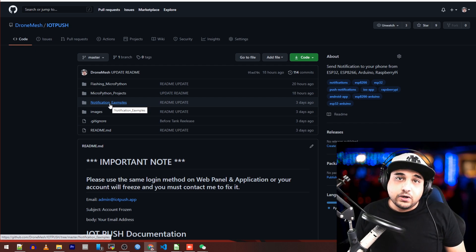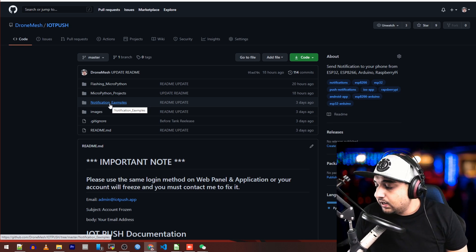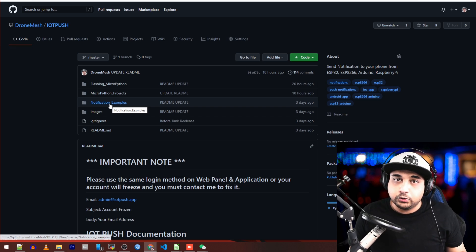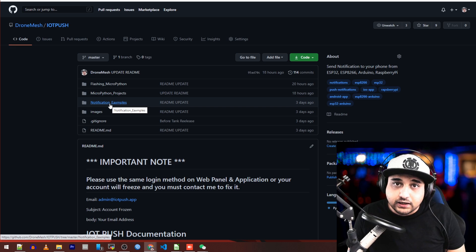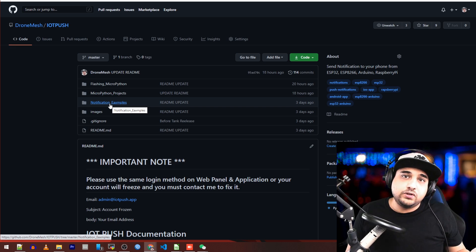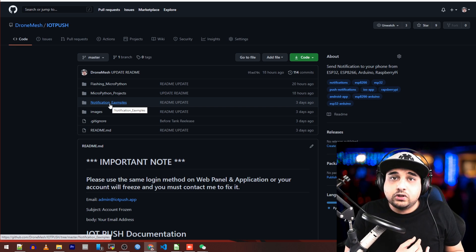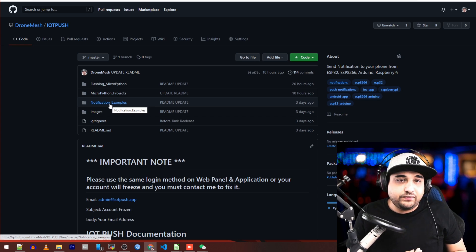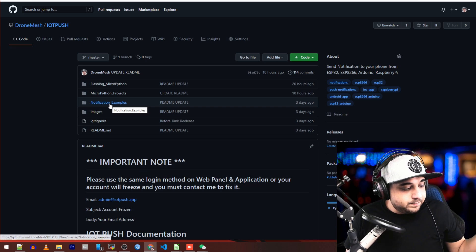I'm creating a really big tutorial that'll get everybody going with MicroPython. I was able to successfully compile a MicroPython firmware for our flight controllers, and I also wrote the drivers for the MPU6000 gyro over SPI so we can take full advantage of its speed. The barometer drivers were already available so I didn't need to reinvent the wheel. This gives you a complete robotic or DIY development board with regulators and sensors already built in that you can take full advantage of.